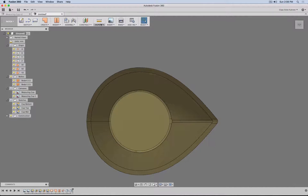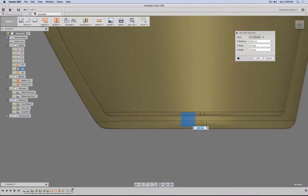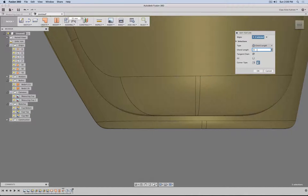Okay, so let's take a look at the section view again, because what's important is that the material thickness between the walls is equal to the material thickness between also the fillets. So let's go back to this fillet and I will turn this one into 5. And you see it's probably growing a little bit. So maybe 3, 1. So you can see how that shapes it. Whoops, a little bit too big.